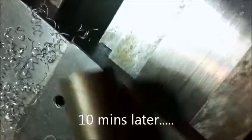So here we go — I chopped this off with the hacksaw. A word or two about hacksaws: you can buy these cobalt hacksaw blades that aren't particularly expensive. This one isn't a flash brand — it's an Ultra. Buy a bimetal 24-tooth blade for a good start. These were about $3.50 each, and they outlast and outcut anything you can get in high speed steel or carbon steel or any other crap. These are fantastic blades.